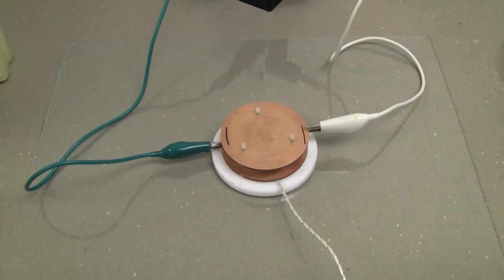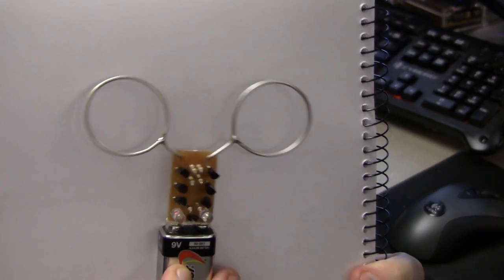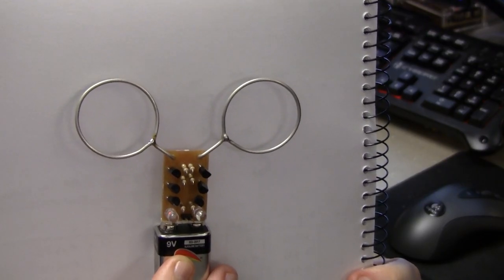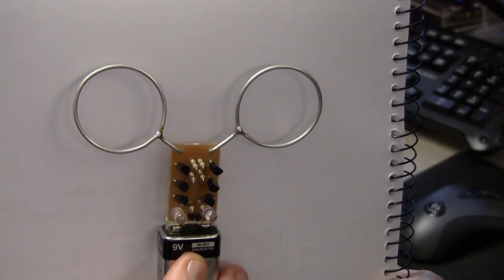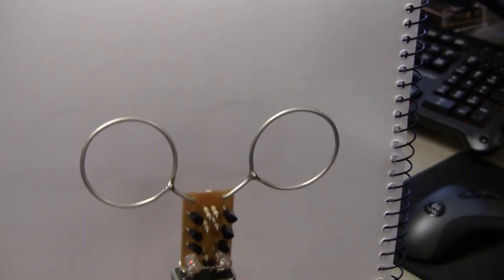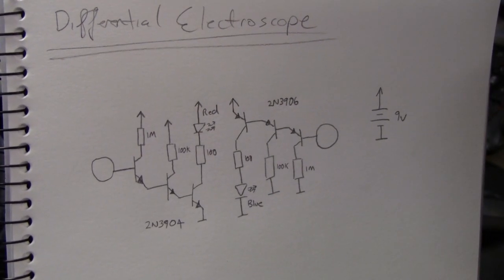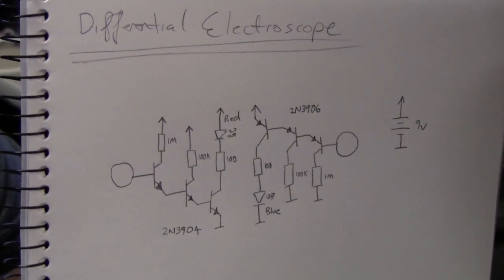Let's have a look at the electrical properties of the end result electret material. To study these electrets, we're going to use this electrometer that I built — it's a kind of differential electrometer that only responds to changes in electric field. It's bipolar, and it will tell you which polarity of charge is approaching — essentially the change of electric field around these antennas. You can see it's got six transistors, six resistors, two LEDs, and that's about it. I built this to pick up people walking around at work during winter, when it gets quite dry and there's a lot of static electricity. You should probably build one because they're a lot of fun and also pretty darn useful, as I'm about to show you.